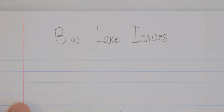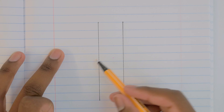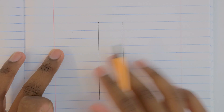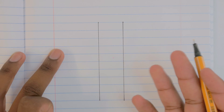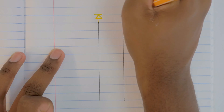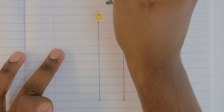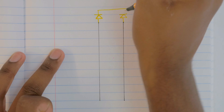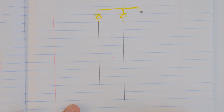The reason I had to add the resistors is because I was having some bus issues, and we're going to go over what kind of issues I was having right now. We have eight bus lines technically, but for simplicity I only need two, so I'm just going to draw two to make it easier to understand. At the top of each bus lane we have an LED.